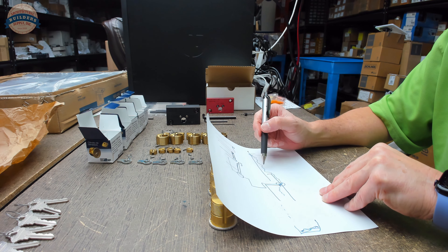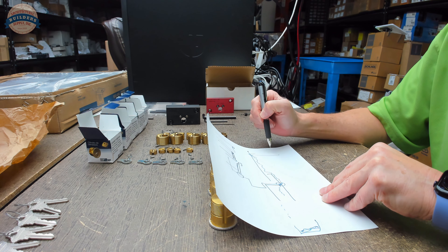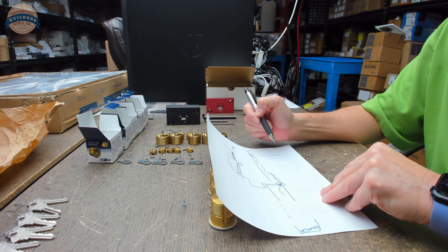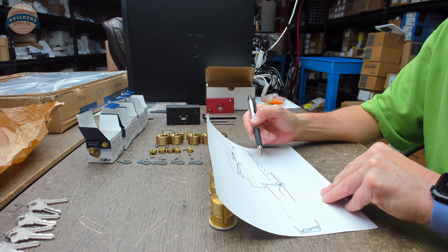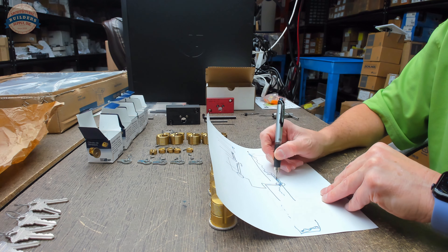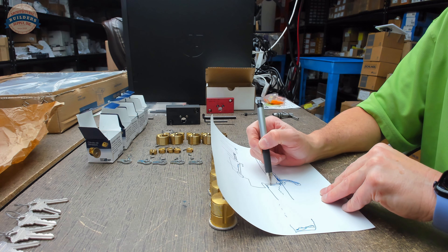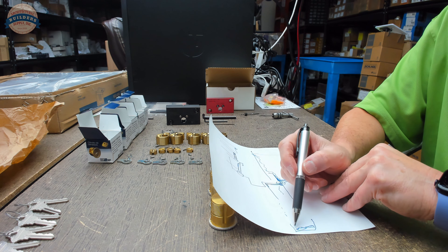What's the square footage of wall above the opening? If you've got a movie theater 40 feet tall with a six-foot opening, that's 240 square feet of wall collecting water. You should always add a drip cap — that prevents the water from coming back in. The flush top cap helps too, and you can also order doors that have the seam sealed. Same issue applies to the frame.